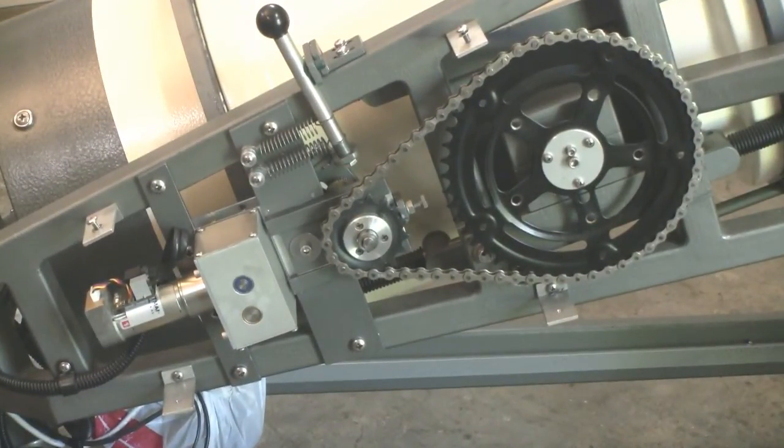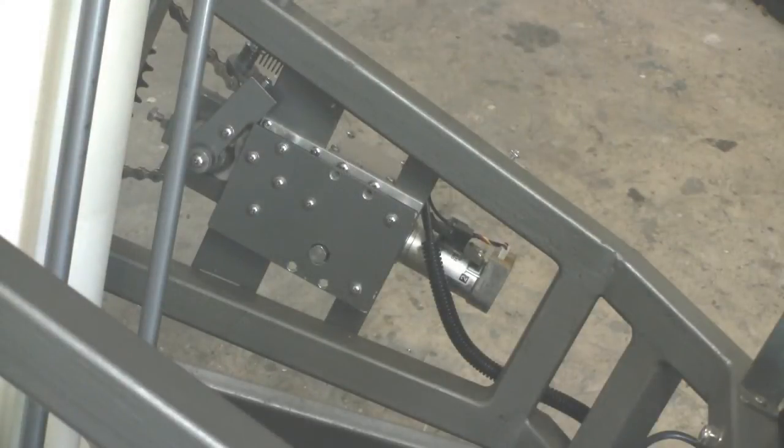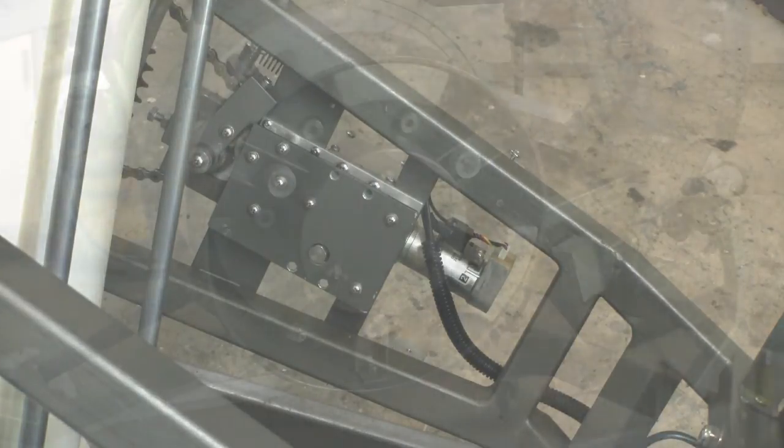All driving gear sprocket shafts have Woodruff keys or equivalent. In addition to the 23-pound mirror weight, an additional 30 pounds of lead provide counterbalance such that the torque needed to raise the scope is minimal. With the telescope tube elevated, one can see the declination axis gearbox, the motor, and the declination axis release.